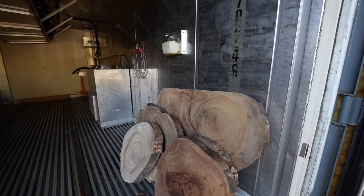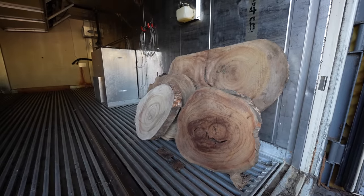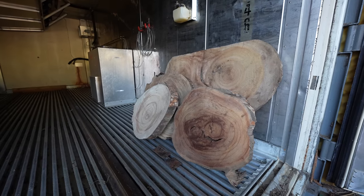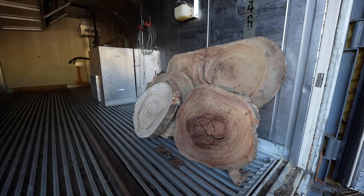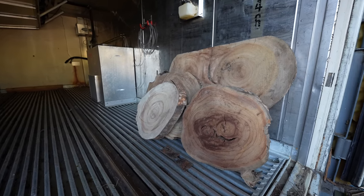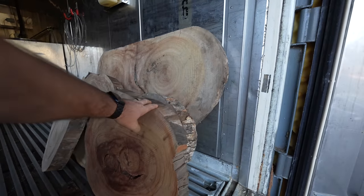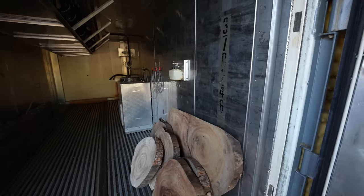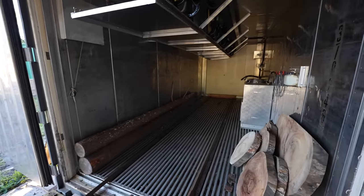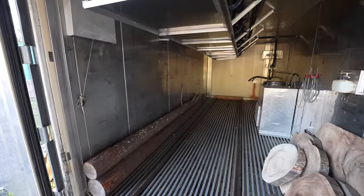I also had some camphor cookies inside the kiln with the firewood. They weren't on the exact drying schedule that they should have been, but the camphor does a pretty good job drying — it doesn't crack too much or move too much like the oak does, so we're able to put these camphor cookies in here and start to dry them down so we can use them for projects. It really sucks tying up the kiln for five months at a time drying firewood when we have all kinds of lumber and slabs that we need to be drying — it makes me think we need a second kiln.